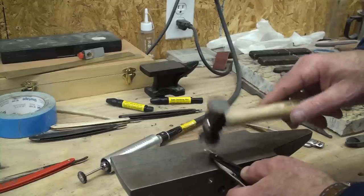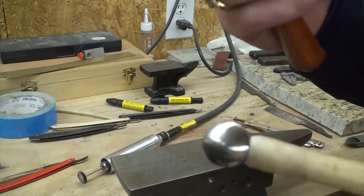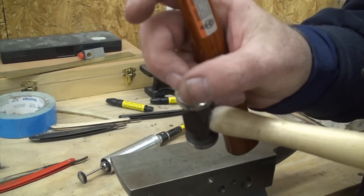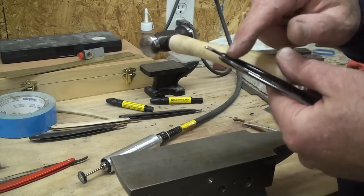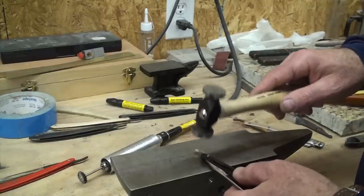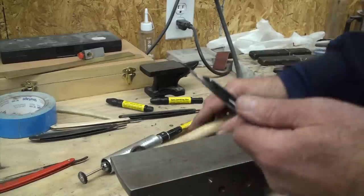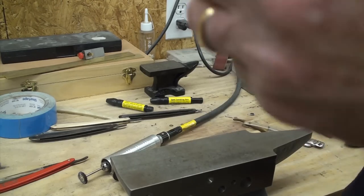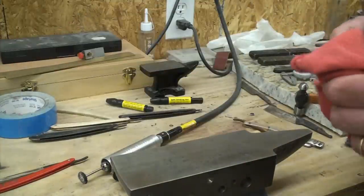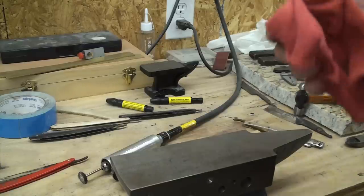I'm using a half-round hammer, and the reason I like that better than just a straight ball peen is that the impact is very precise. By having a half dome, it widens the impact area. So I'm not as apt, if I miss, to totally bust the whole thing up. As long as I can hear metal on metal and I hear it solid — see how light I'm tapping. Minimal pressure. Feel the difference. Yeah — and now it's not too tight, not too loose, it's centered. We did the same amount on both sides, fairly close.